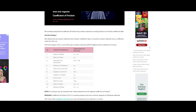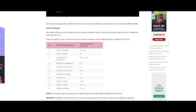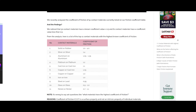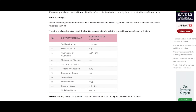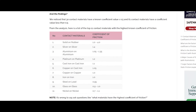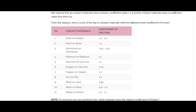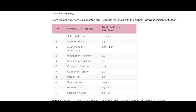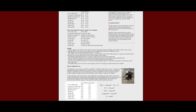If that seems overly complicated, let's talk about why I think it's worth a shot. So let's talk about friction coefficients. Here's a list of material pairs and their common friction coefficients. Loosely speaking, a coefficient of 1.0 means that it takes as much force to move an object sideways over a surface as it would to pick the object up. So a coefficient more than 1 means that we have to exert more force to move the object sideways than gravity is exerting on it.